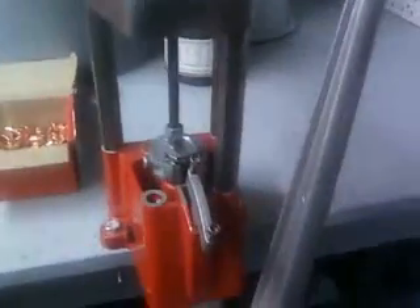Okay, I'm going to show how easy it is to reload ammunition in my basement here. I'm going to grab a brass first, put it into the press, pull the handle, and this will knock out the old primer — I don't know if you saw, but it fell.